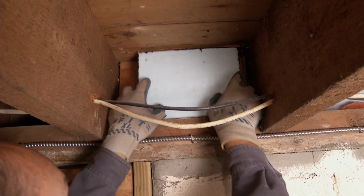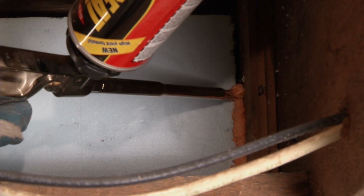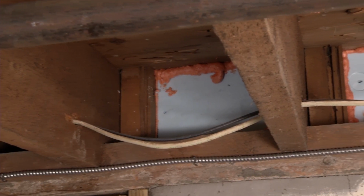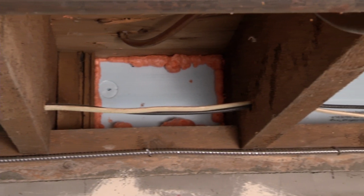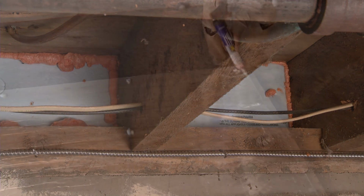When insulating this joist area, also known as the band joist, you don't want to use a fiberglass bat, which can allow air to move through it and moisture to get behind it where it can condense on the framing. Instead, use a foam block like this. Cut it a little smaller than the opening so you can get spray foam around the entire perimeter of the block. To meet today's standard of R20, I'll use 2 layers of 2-inch foam, both sealed in place.